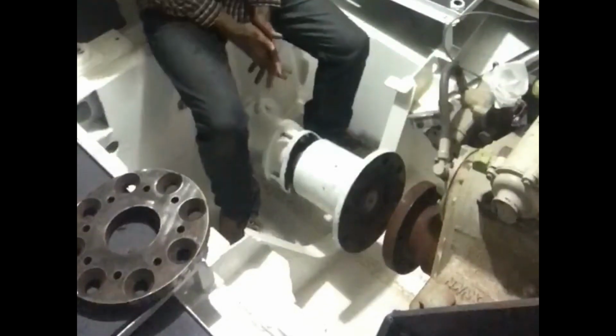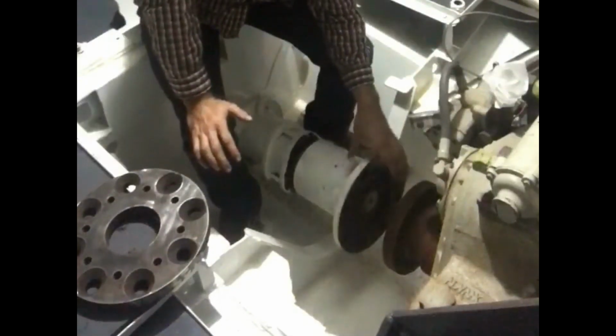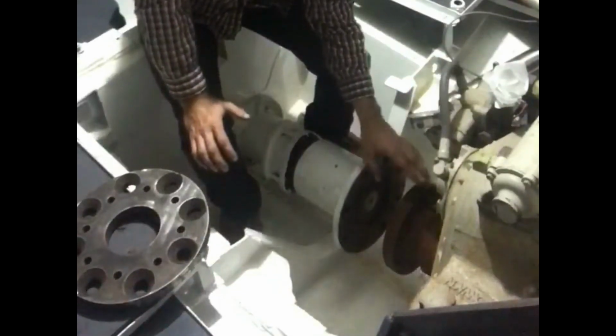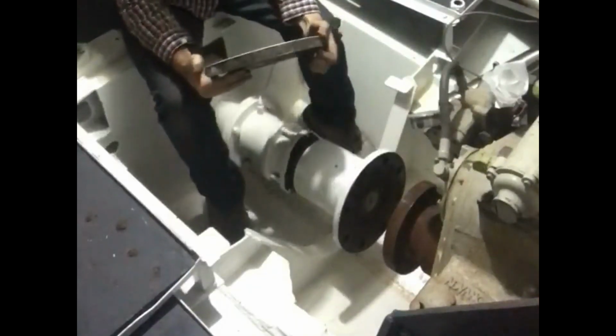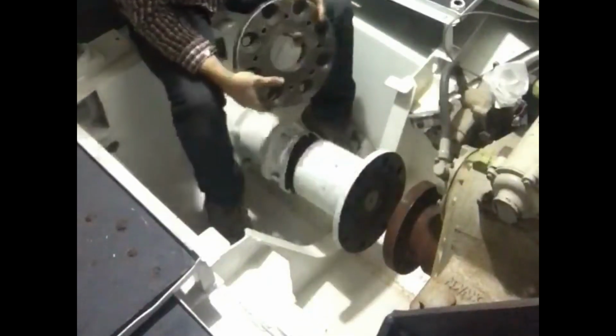So about 3 years ago when we bought the boat, I realised that the original propeller shaft coupling is not going to fit with my new gearbox. So I had to get an adapter between the two of them made. So I got this big lump of steel here machined up. That's 25mm thick mild steel, and it was machined up to suit.